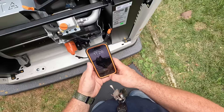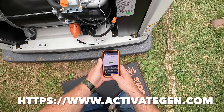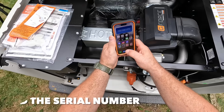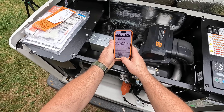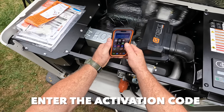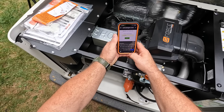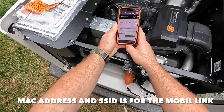It's always nice to get those approvals. You want to put the inspection sticker on the transfer switch or on the generator — I like to put it on the transfer switch just in case something happens and we need to confirm it passed inspection. The town has it on record from the permit. Getting the serial number is very important so you get the activation code to start the generator. Without this code you will not be able to start the generator in manual mode or auto mode. It also lets Generac know the generator has been started and is active and serving.